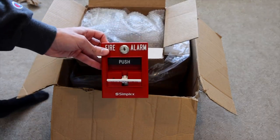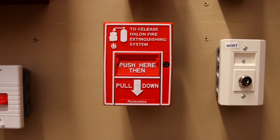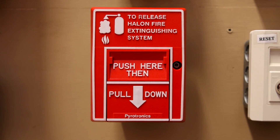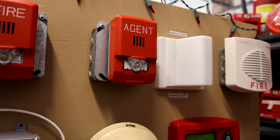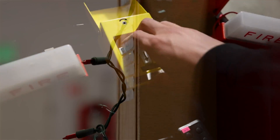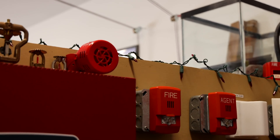Fun fact: that same subscriber or group of people also sent in this agent fire alarm, which was really nice. Below the Simplex pull station is the Powertronics MH501 Pull-to-Release Halon pull station. This alarm is wired into the fire alarm control panel and will activate the agent alarm through a relay. I also installed some red Christmas lights — the same lights used in the New Year's fire alarm sounding — and when the fire alarm control panel detects a fire emergency, these lights will activate through a relay and turn on.